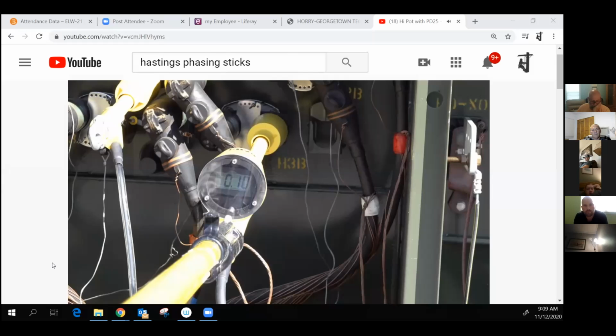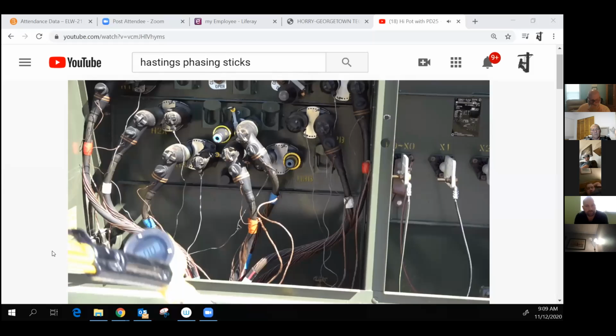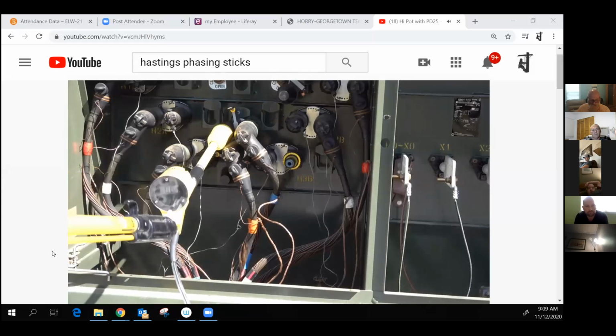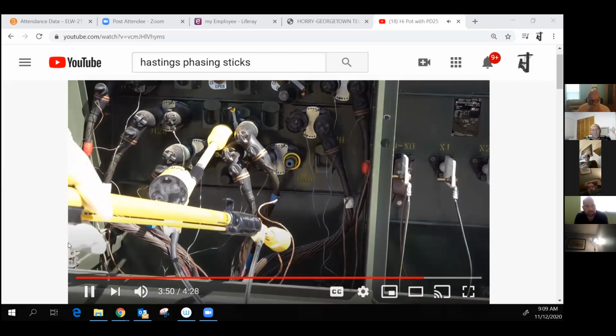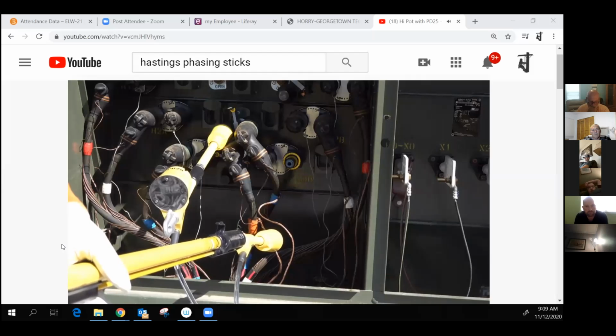If your utility would like to develop a pass-fail criteria, it's important to remember that on a PD25, every 100 volts is equal to 2 microamps of leakage. That way, if a reading is higher, you can actually determine how much leakage a cable has. Since this cable was good and able to accept the full potential charge, we now need to discharge it. Again, remember we need to use the probe with the high pot connected to source, which is the energized cable. Take the second probe and touch it to ground. Notice the reading on the meter. It will spike high and then go to zero. Now the cable is safe to handle.